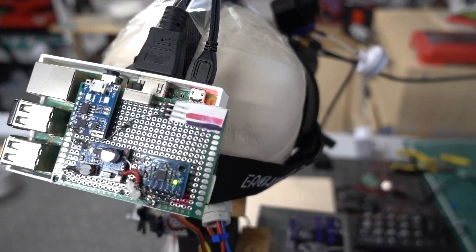I've got a first success — I wrote several test programs and I can see the values change. But testing is finally over with the result that it doesn't work. Simulating key presses in Python works great with notepad and editors, but does not do well with games. I first wanted the elegant solution with just the Pi controlling everything over GPIO, but now I'm going for the crude but better solution: using an Arduino Micro, reading the motion sensor with that, and porting it over USB to the Raspberry Pi as an input device, like a mouse.